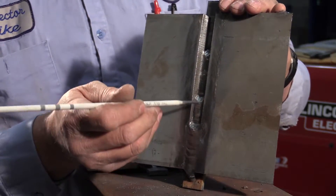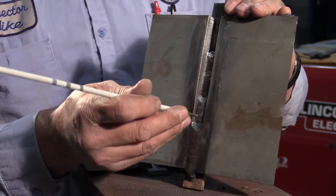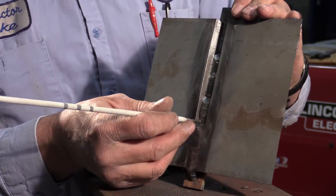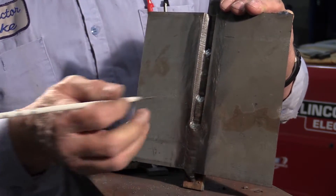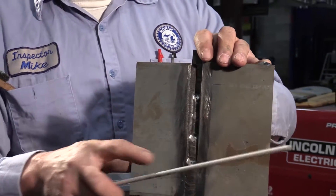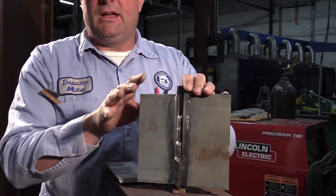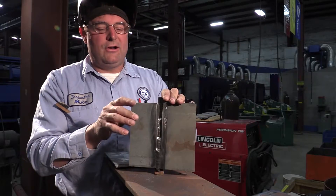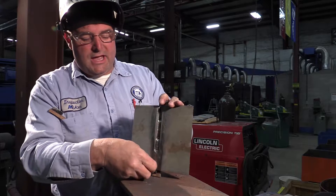The mid pass — all I worry about is filling it up for the cap. I like to be maybe a 1/16 below surface so the cap can finish it off. I should have a little divot where it burns into the root pass. Then I let it cool — that's a big thing, most people get in too big a hurry. This isn't a very big weldment; it's going to heat up fast. If it's over 250 degrees I don't weld. I like to weld at about 150 degrees — anything hotter than that I run the risk of undercut and issues at the top. Then I run the cap.